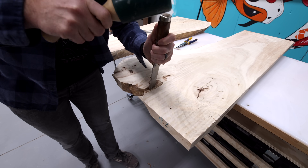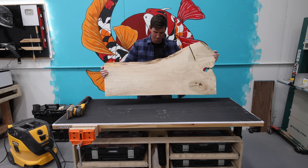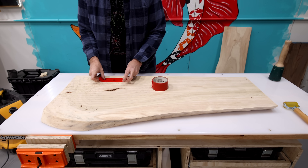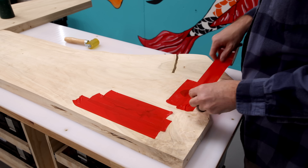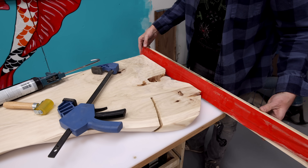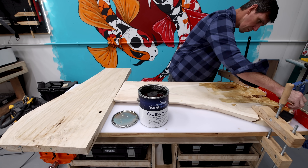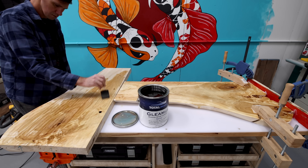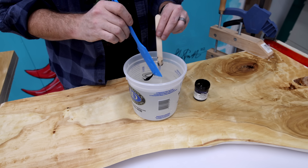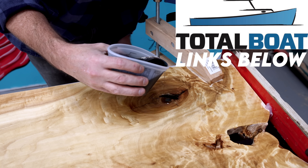Setting that epoxy panel aside to cure, I jumped back to working on the slabs — cleaning up bark inclusions and knot holes to fill with epoxy. I also cleaned the live edge, which had a little bit of bark residue that I just sanded clean. I just built a handy little workbench with a UHMW polyethylene top, which means I can pour epoxy directly on it and it won't stick. It's especially important with light wood like cottonwood to seal the surface to prevent epoxy staining, and I use Total Boat Gleam Varnish for that. For these pours, I'm using Total Boat Thick Set Epoxy — pourable up to two inches thick — tinted a smoky black color. Total Boat has been a long-time sponsor of the channel; links and a coupon code for 10% off at TotalBoat.com are down below.